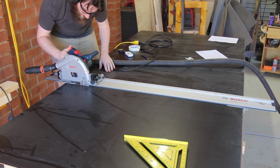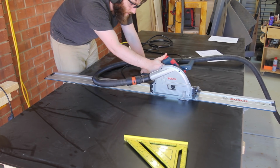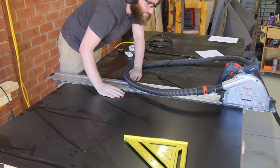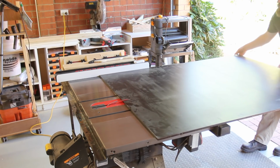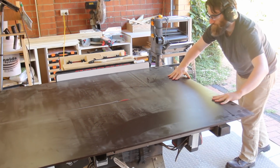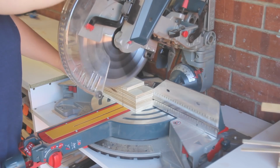I have trouble stretching across an entire piece of plywood, so I got Paul to rough cut the material for the bench top. We decided to use form ply, which is a hardwood ply with a phenolic coating. Form ply is typically used for concrete moulds. We chose form ply because we wanted something stronger than pine ply, had a colour we liked and would resist turning finishes and wet turning debris.